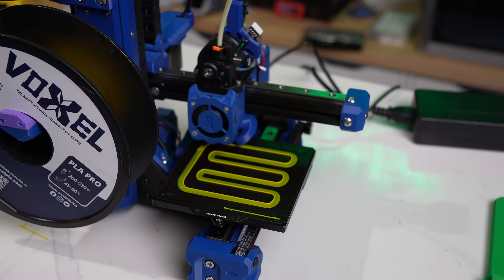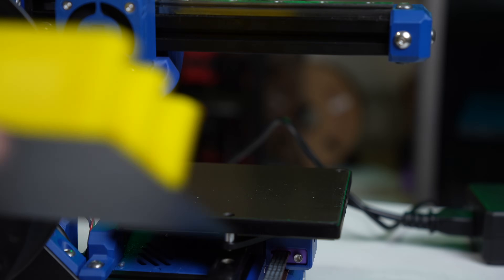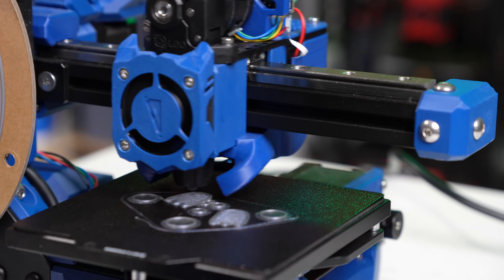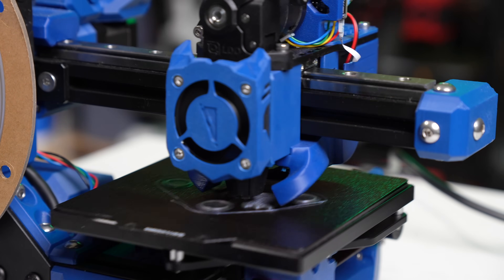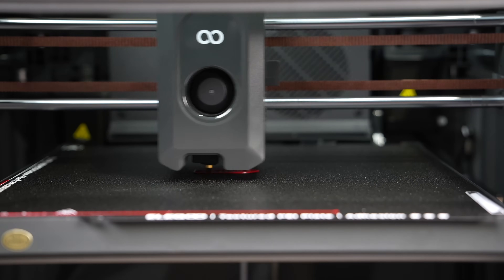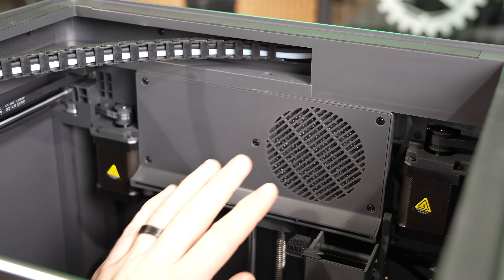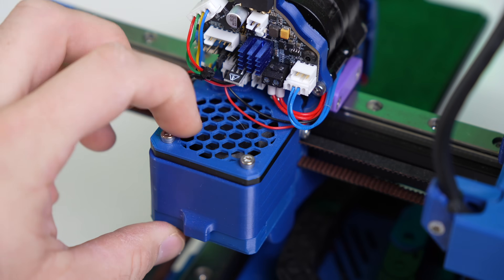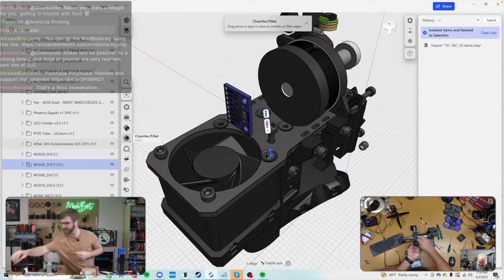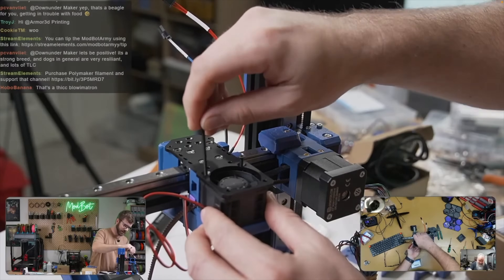The Rapido 2 Ultra High Flow is giving me about 20 cubic millimeters per second of flow with standard PLA, without using any extreme temps and just using a hardened steel nozzle — and if I needed to bump that up, I'd just swap it with something like a CHT nozzle. The biggest limitation I've found is with part cooling. While this makes sense since most high-speed printers use a large side-mounted auxiliary fan, this printer does use a beefy 4028 in the toolhead, but it's just not keeping up. Some optimization might be done with the fan shroud, and I might look into upgrading to a higher quality fan.